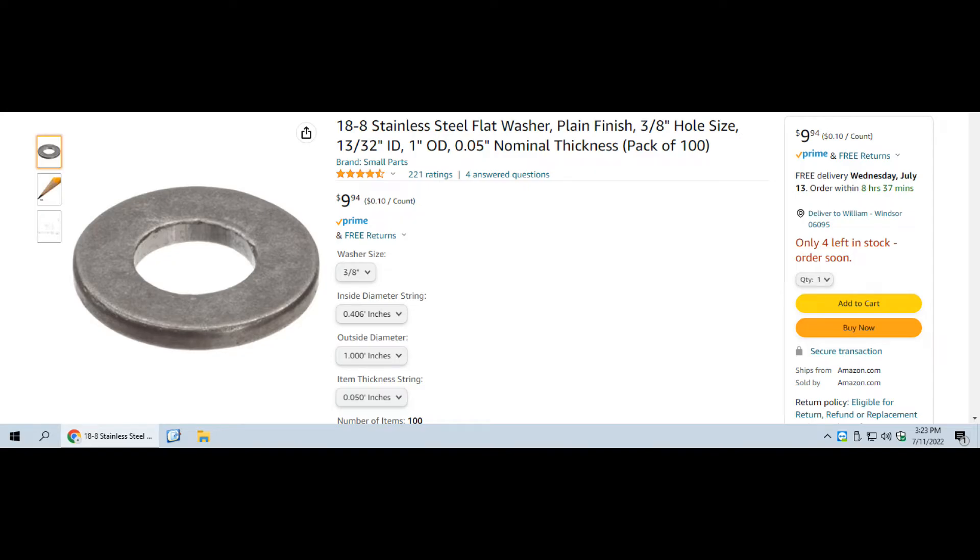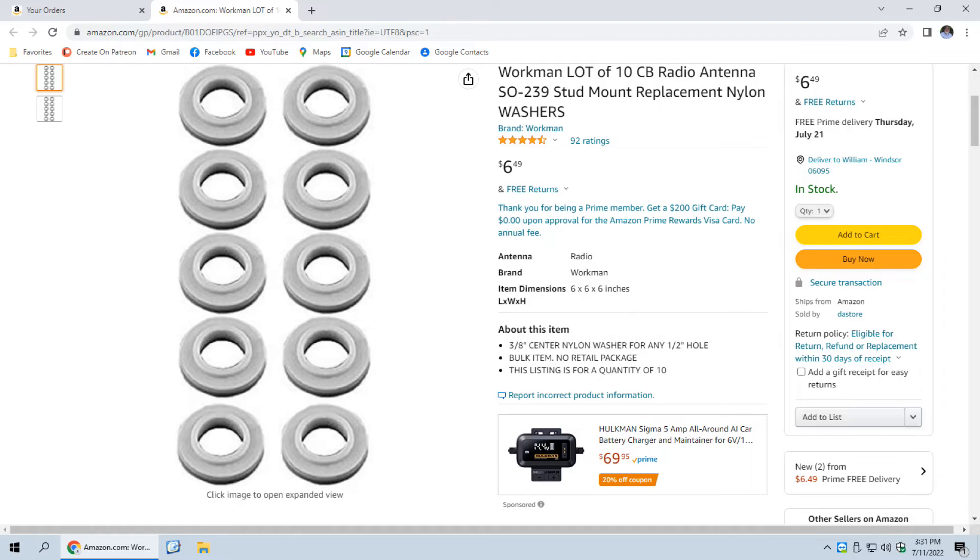Finally, let's talk about the most important one, which is called a stud mount washer. Basically it's a washer with a lip that goes into the hole you drill into the box, keeping anything from touching the hole you drilled through the box. These are the isolating washers — I use one on either side of the box wall. Those are the ones that keep your driven elements from grounding out. They came from Amazon; it was hard to find them because it's hard to describe them, but Workman makes a replacement set.